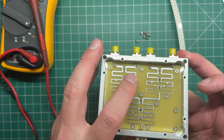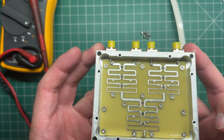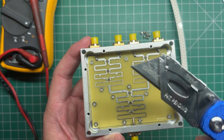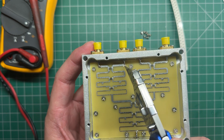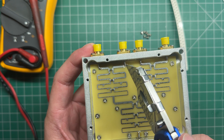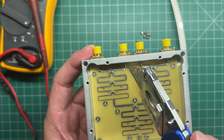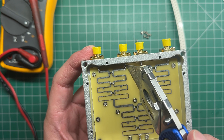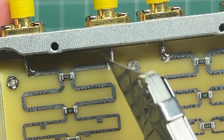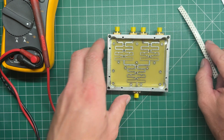On this second output you can just see I've cut the track. You have to be a little bit careful — I just used a sharp Stanley knife and cut as close as I could to the center pin connector. You can't desolder these pins because the track runs underneath them all the way to the edge of the PCB, so you do have to cut back here as close as you can. I'm just taking out a little slot out of that portion of the board.